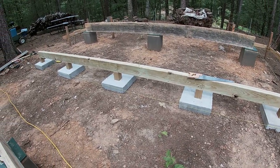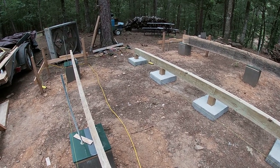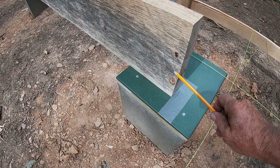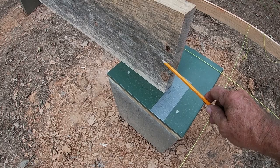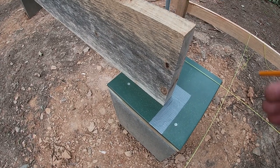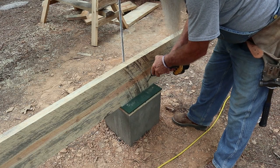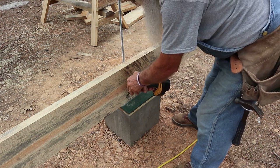I set the top of the girder that's going down the middle of the building — the joists will cross that and be supported by it in the middle. So we're going to have a really strong floor. I've got four by four posts underneath it sitting on a pad every four feet. The first floor joist will set in between these two two by tens going down the length of the cabin, and I'll cut another long two by ten that'll come up to that. I'll show you that when I get it cut and ready to set in there. I've anchored this first board of the beam down to the top of the piers through the metal and into the treated two by twelve with a three inch torque screw.